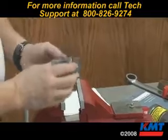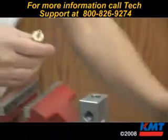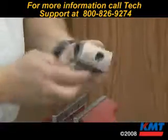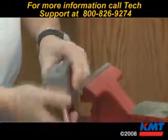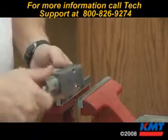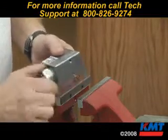Once we get everything cleaned up, we have a position tool that we will insert in the bottom. This prevents the seal from being pushed down too far. So use the valve nut, thread it back in there by hand. Just hand tight.